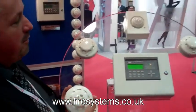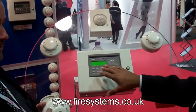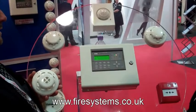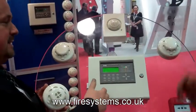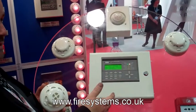There are options associated with a heat detector and a smoke detector in terms of sensitivity. You answer the questions at the panel — basically you just go through, it's an easy step through. So it asks what device number do you want me to be — just select device 1.